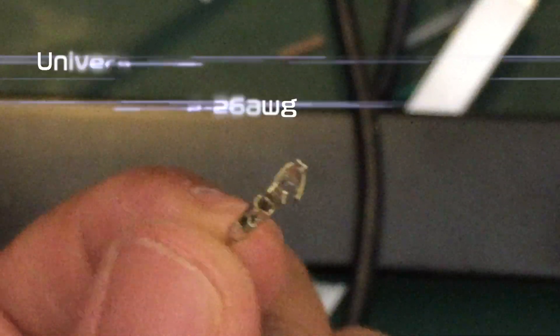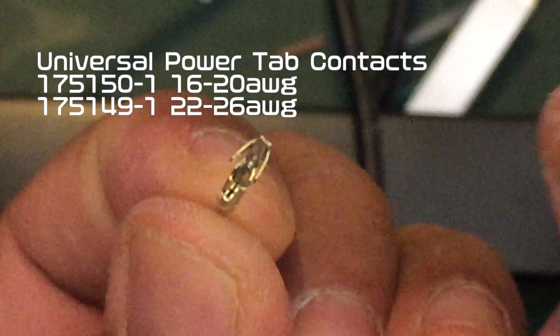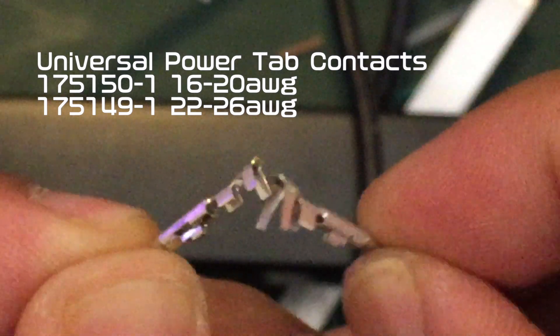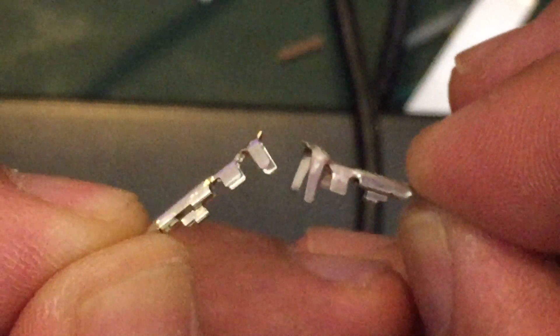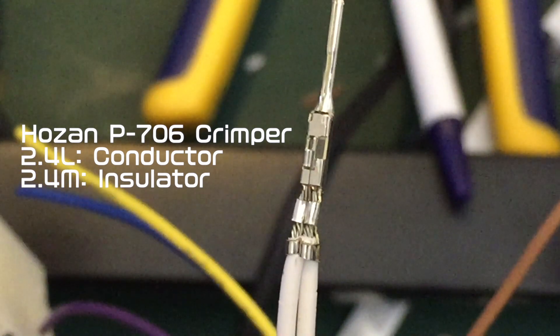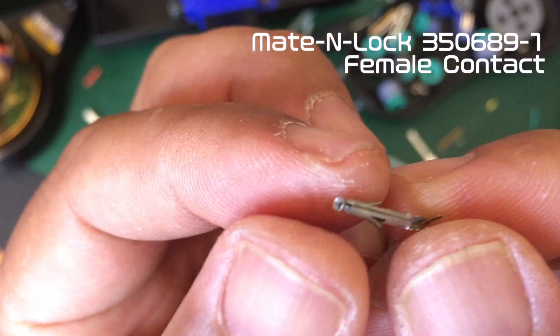The male pin for the female universal power connector is made for 22 to 26 gauge wire. The second pin can accommodate 16 to 20 gauge wire — you'll need this pin to connect two wires to one pin. Here's an example of daisy chaining: use 2.4L to crimp the conductor and 2.4M to crimp the insulator. This is the female pin for the female Mate-n-Lock connector.